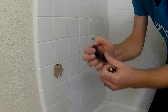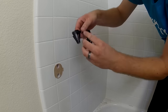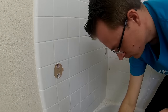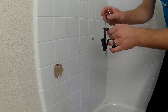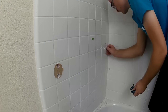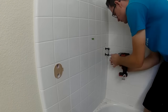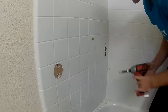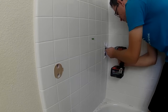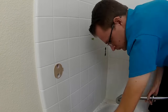Here are the wing-its — they basically just snap together. If you've never used wing-its before, they are quite the thing. They come down in the neck when you screw them in; those three wings hold on to the back of whatever substrate you have, creating really strong holding power — especially through tile. They're meant for mounting through tile, drywall, concrete block, or whatever isn't too thick. Get it in there, tap those screws in to get it in place, and then tighten it down to suck that wing-it in.